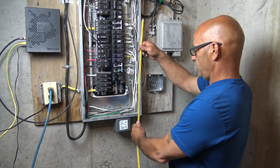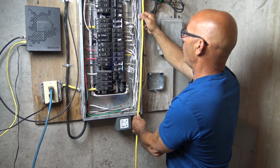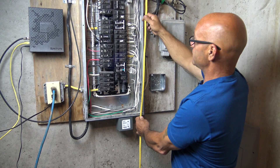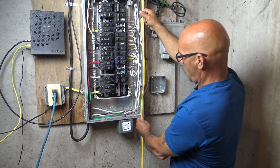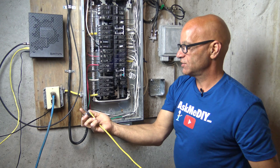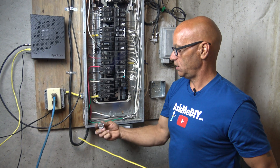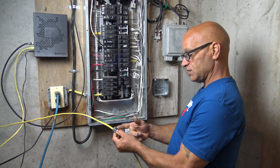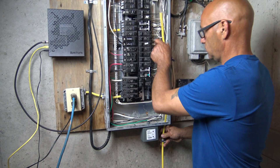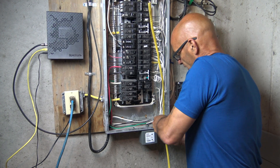Now it's time for our wire — we're coming up through our first knockout. This is a 20-amp circuit, so we have 12-gauge wire. Leave enough wire — it may seem overkill but you don't want to end up short. Get a little measurement with your finger, slip it over our non-metallic connector, tighten the screws down outside of the box, and install it. Slip the nut over it and we're done with that.